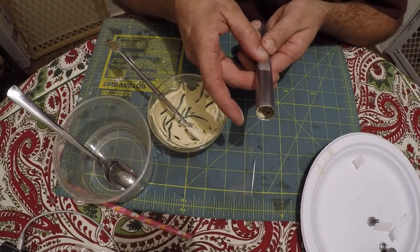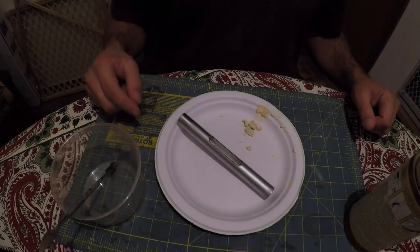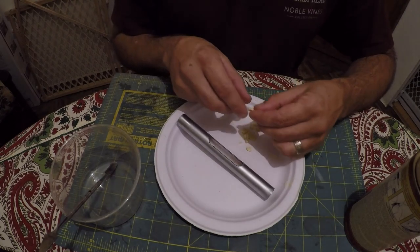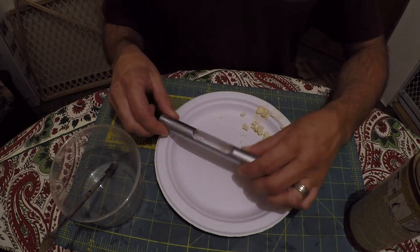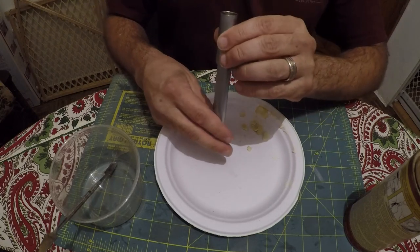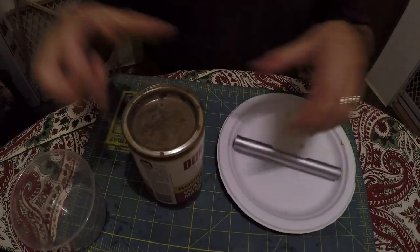Last chance to get the vial lined up good. Once it looks right, grab a Q-tip and clean up the ends of the tube before the plaster sets. After 24 hours the Durham's putty is solid — adding the flour really extended the curing time, but it's solid enough now to bed the other side. You can kind of see in there — there's a little plug and it ran out a little bit, but all the way around the glass on that side it's all bedded in, so it's not going anywhere.